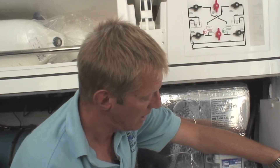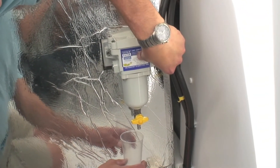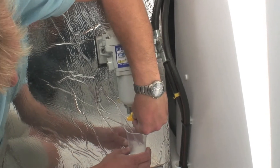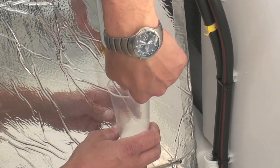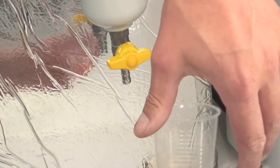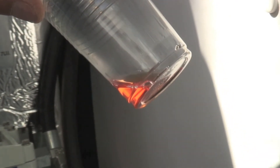Fuel filters, and we're going to check that we've got the right amount of fuel in the tanks, which is done on the fuel gauges. You might have sight gauges on your tanks. Make sure the taps are open to supply fuel to the engines. We're just going to take a little sample to make sure the fuel is clean. This type of filter has a filter in the top section which if you need to change you unscrew, take the top off, put a new one in. We can drain a fuel sample here by push and twist — just get a little dribble of fuel out the bottom, bubbling out nicely. Turn, let it drip, then hold it up. The plastic cup's great for this because we can see it's lovely and clear — no bits and no water. Tremendous.